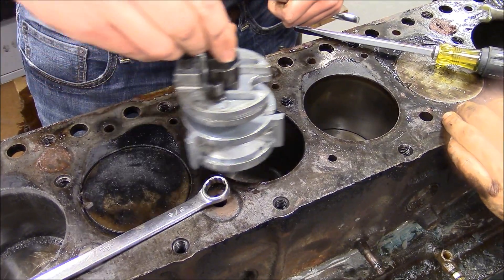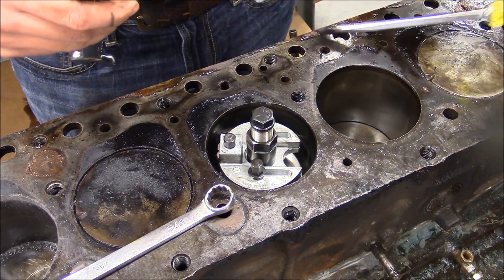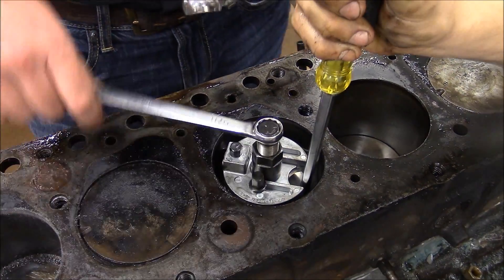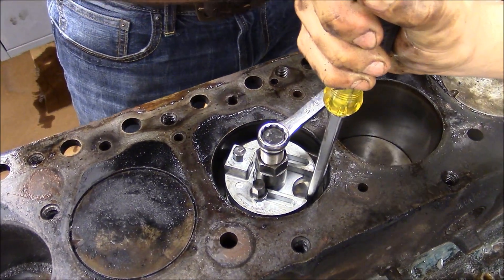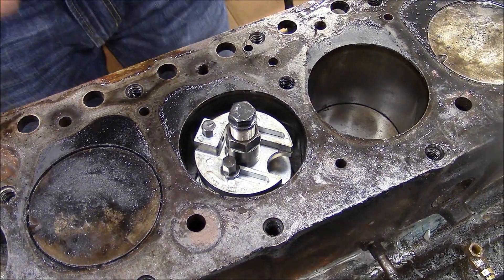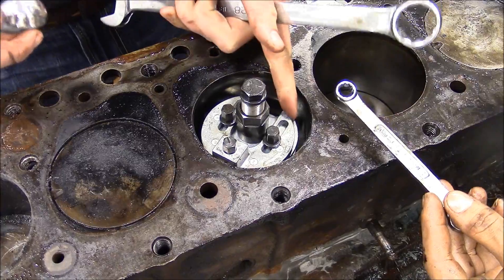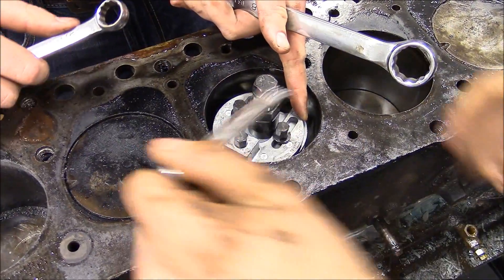Place the tool in the cylinder — it goes down like this. You'll need to use a screwdriver to make sure it's not spinning when you're tightening the top nut. Start to tighten it and just snug it up, but don't go too tight because you can damage the cylinder walls. After that, push the blade against the cylinder wall — just push it out — and put pressure on it with your finger while you tighten the two screws to hold it in place.